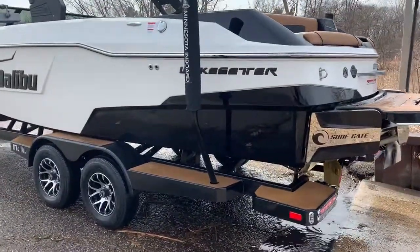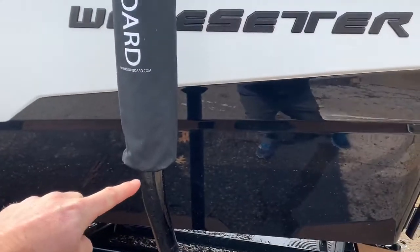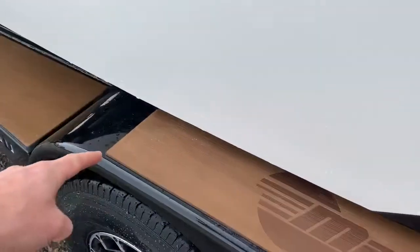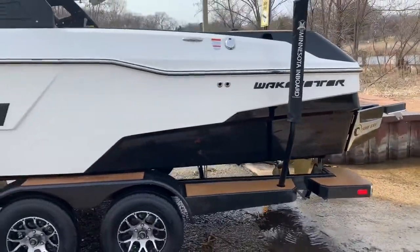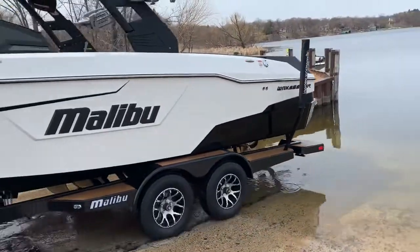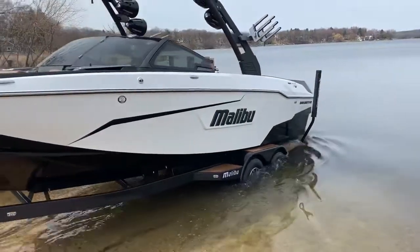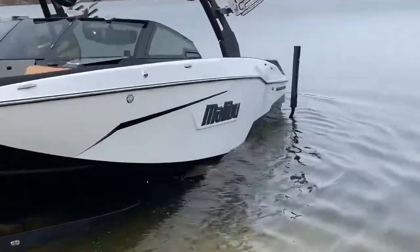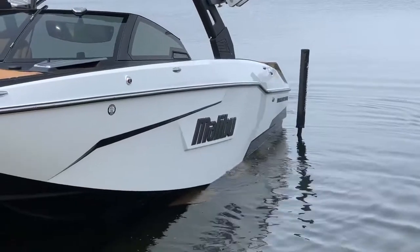Other important things to think about: the depth of the trailer in the water. Your gauge when you're looking in your rearview mirror is your guide pole here — you want the water level right about the bottom of the guide. You're also going to see the top of your fenders go underwater. As this boat goes back into the water, you're looking in your rearview mirror — this is both for unloading your boat and loading it back onto the trailer.